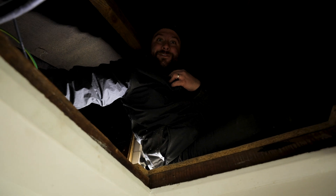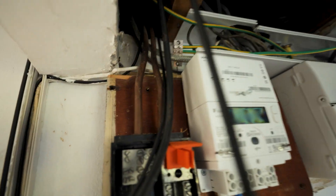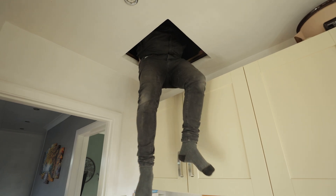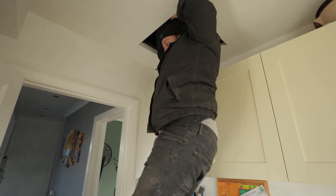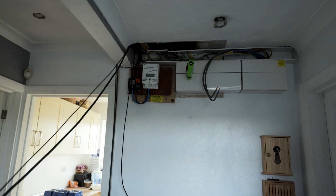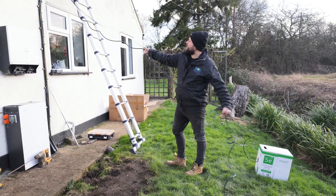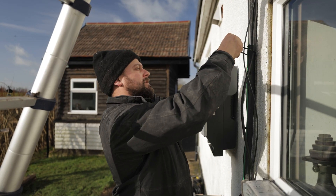Can you see if you can see the end of the cable for that hole? Yes. It's a sparky as well. There we go, a little bit of slack to pull through. So this cable is main power and communications from the Give Energy inverter. Goes through the side wall, across the loft, and into the top of this fuse board on the right hand side here. This is the other end of those cables. We're going to dress it around with the other cables that are already in place and into our inverter here.